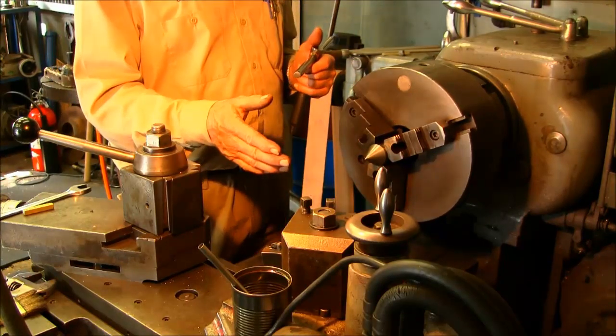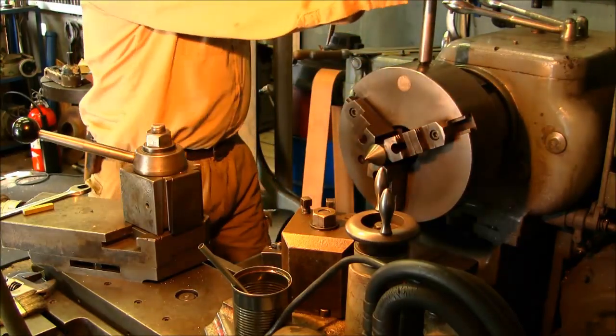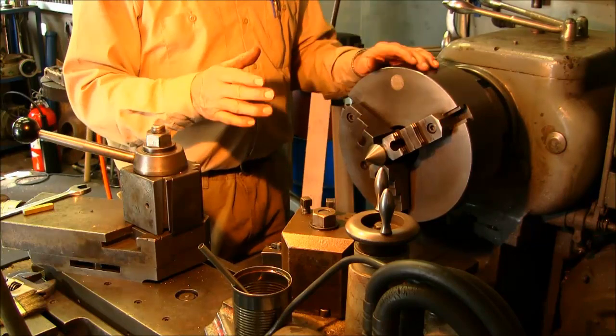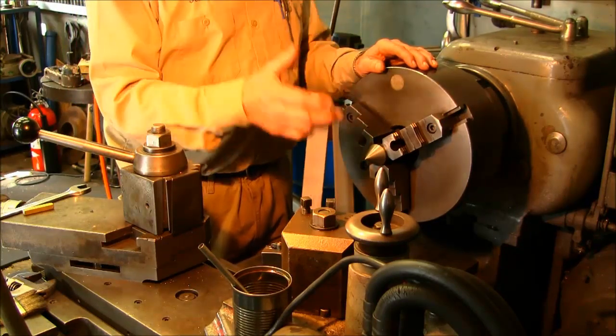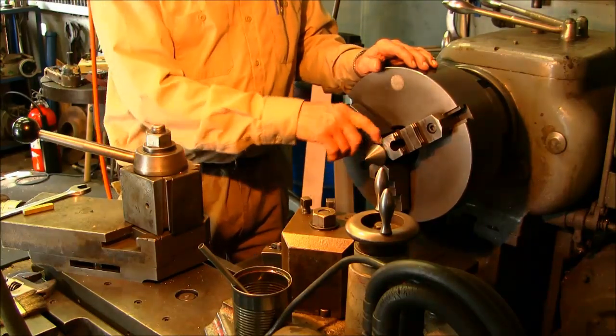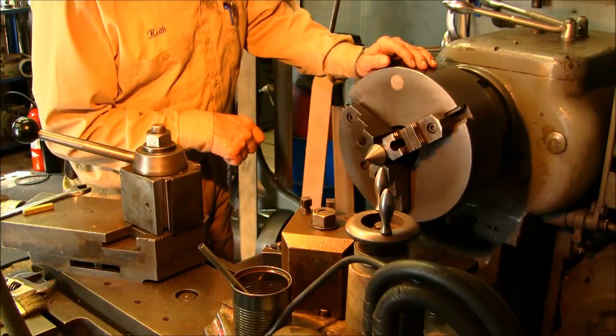You're not really running that hard, but I've seen mishaps with tool pressure and things like that, and I've seen people lose the grip between centers. Most of the time it causes harmonics and you're able to back out of it before you actually fling the part out. But it is good practice, I feel anyhow, to put a shoulder on there.